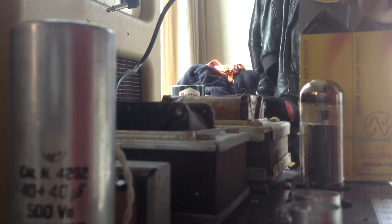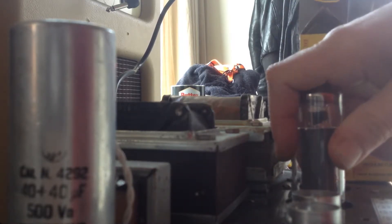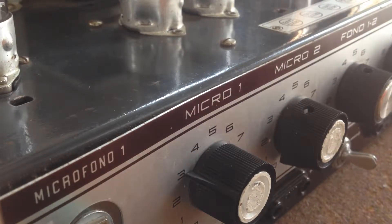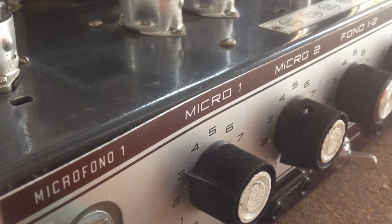I'm putting in some new tubes, but because the bias was terribly off — the original tubes in the set were not matched at all — so we'll check the bias with these new tubes and then maybe correct it. Next thing we should be checking is this phono knob, which feeds in some noise into the circuit if it's left open and doesn't really change the tone. It just adds noise and isn't doing anything, so we should cut out that circuitry.